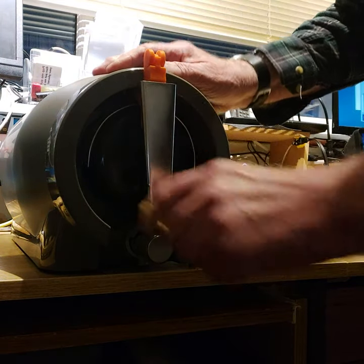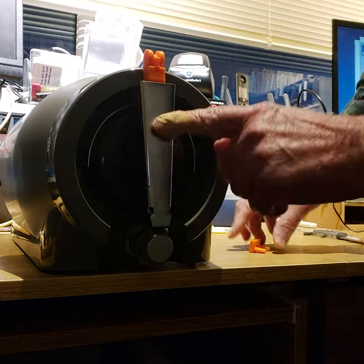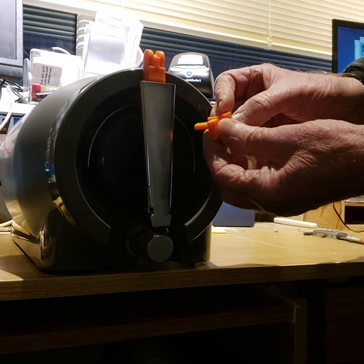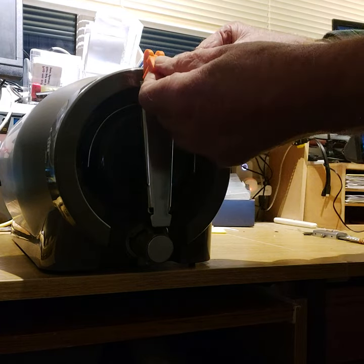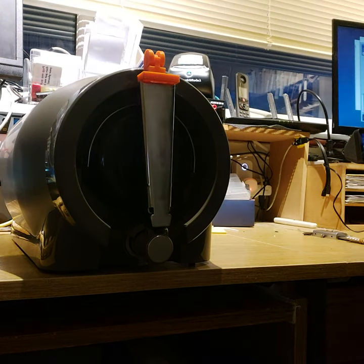And if you have a painted version of the tap handle, then that will fit quite snugly. Mine is stainless steel. There is more tolerance, so there is this little wedge which just slides in and gives it the stability it needs.